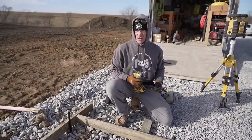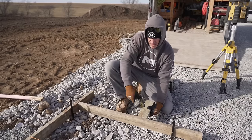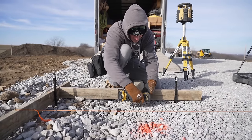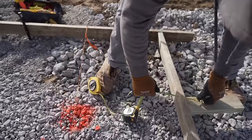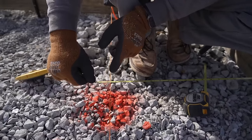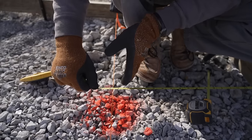If you're doing this by yourself, it can be quite difficult to pull tape. This is why I do the 90-degree batter board setup — I put a board in here and then I can put a screw that is exactly two feet one and a half inches off that string line, so I can pull eight feet across here by myself. Since this string line is the edge of my columns with an inch and a half girt out here, that's why I'm going two feet one and a half — so I have the actual outside edge of my building as my reference.